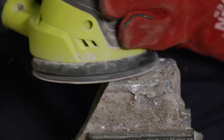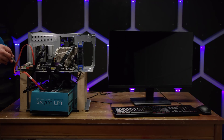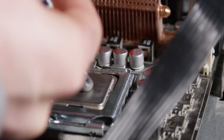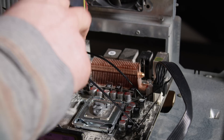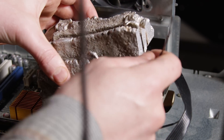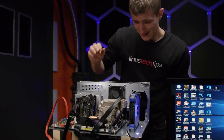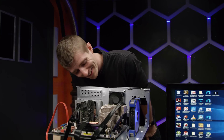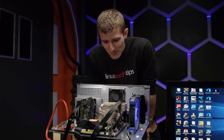The processor chosen was an Intel Q6600, mainly because the old Asus motherboard it was on was the only one where the heat sink didn't interfere with the VRM. To help fill in the air pockets on the bottom of the heat sink we added a more than generous dollop of thermal paste, topping off the creation with a handful of zip ties. This was actually the first time I laid eyes on what three of my staff had been doing all week.